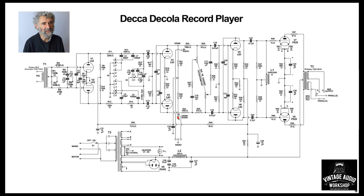Going to the next stage, there is a radio input that came from a transformer output on the radio unit, so like the phono input it is a balanced input. These valves aren't needed because the output from the radio is at a high level. The switch — shown somewhat ambiguously — in the ground position connects the input valves; switching down disconnects the input valves and connects the radio input instead. Exactly the same arrangement applies on the other side, and the signal is then applied to these two valves for amplification.